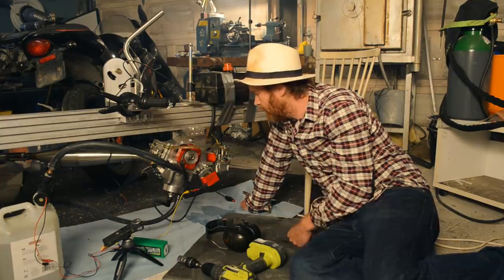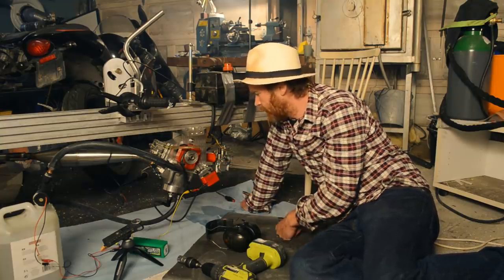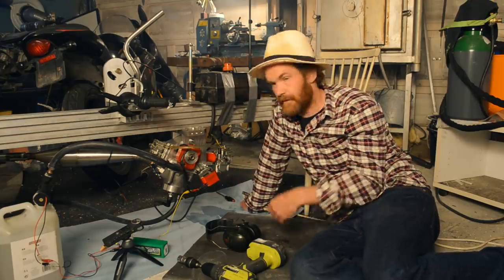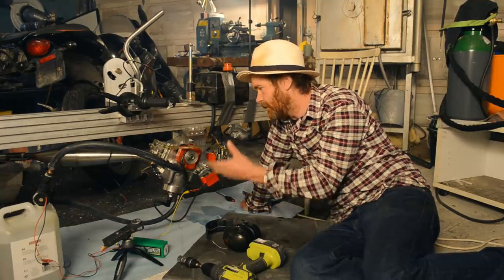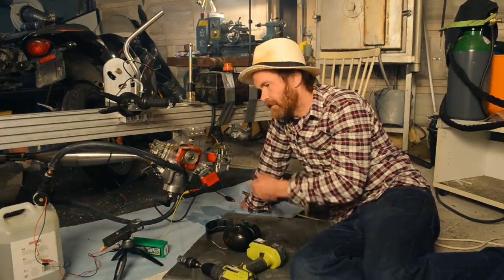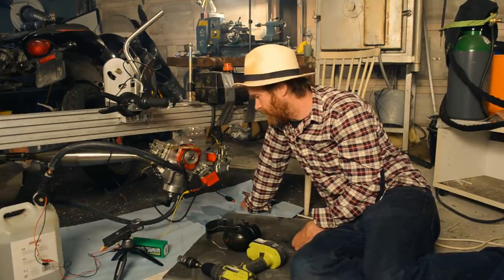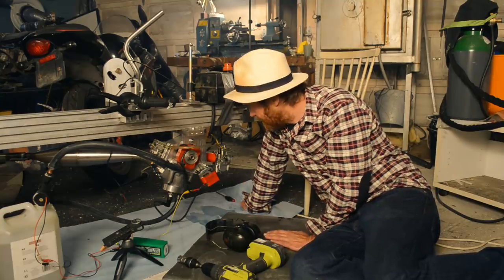With some tuning we might see some RPM. But it will probably be difficult with a carb, I think. But hey, we've got the EFI setup. I also think it will be difficult to get it up to some real RPM without any load on it. Just free revving. It's kind of like it's running away from itself in a way. That's my past experience with these small 50cc engines anyway.